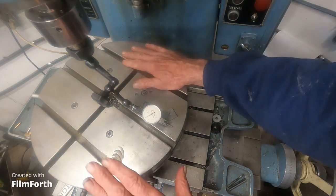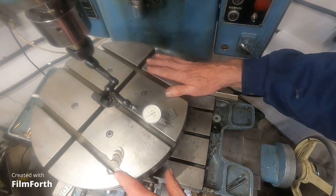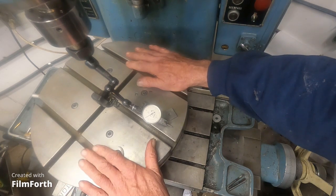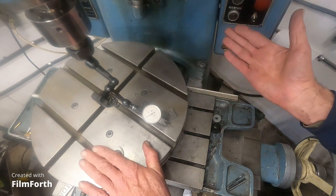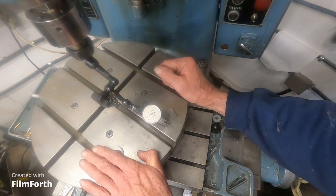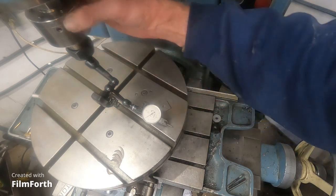What's sitting on here is a Gordon 15-inch light-duty rotary table. I have this on there because the stuff I put on here — this thing takes a beating; it took a beating before I got it. It looks like somebody parked it with an end mill. But this is really quite an accurate table, even as old as it is, and it's within one ten-thousandth. So we can narrow the tramming error down to somewhere around two ten-thousandths. It's a little bit out of level, but we're looking good on tram — really not bad. I'm quite happy with that.